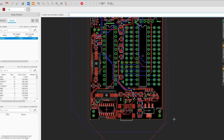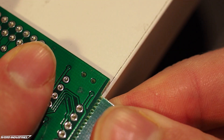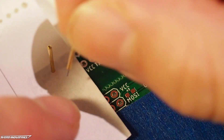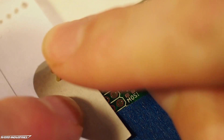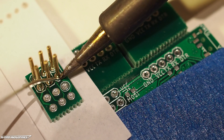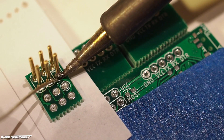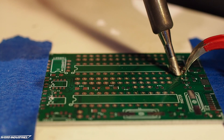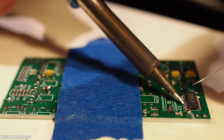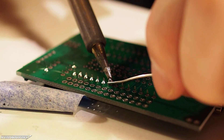After the circuit diagram was drawn and the PCB was laid out, I continued by soldering the components and bringing all the parts together. The pogo pin adapter is made by breaking off the pin holder and soldering both the pogo pins and male headers. Pro tip: when soldering the pogo pins, put a piece of paper between the PCB being soldered and a couple of offset PCBs. These offset PCBs give a nice distance for the pins, while the paper means you can still remove the main PCB after all the pins have been soldered. I started with all the low-profile components like the SMD passives and ICs, then moved on to bigger components like the USB jack and oscillator before finishing with the male and female headers.